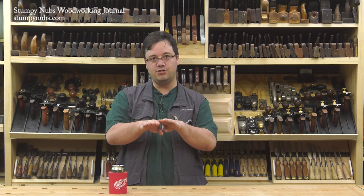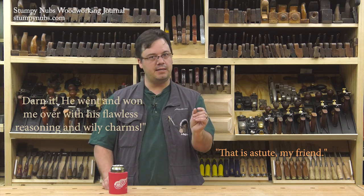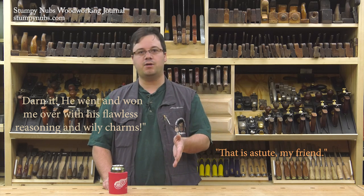You'll especially see the results of this when you try to trim a small strip from the edge of a board, or if you're cutting with the blade raised high above the table. It's no coincidence that just about every company that makes thin kerf table saw blades also sells metal stabilizer plates you can mount next to them to help stiffen things up. These do help, but they also reduce your cutting depth above the table. And heat is a concern too — if you're ripping a long thick board, things can heat up no matter the thickness of your blade. But that heat is more likely to warp a thinner blade than a thicker one, which is why thin kerf blades struggle to make glass-smooth cuts in those situations.